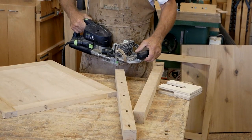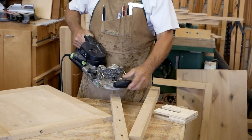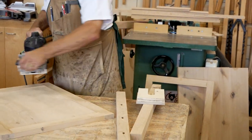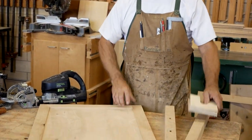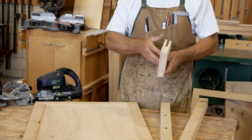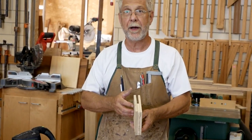So you have to make a different height adjustment on that jig for each application? Yeah, and you have to make a new jig for each one, but this is pretty standard. I made these panels just a little over 3/4, about 13/16. These are 1¾, so I did have to adjust my piece of plywood here. I ran it through my big sander and did some test cuts and got it down to the right height.